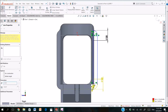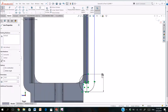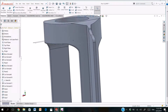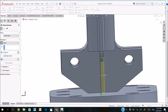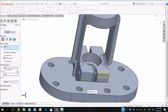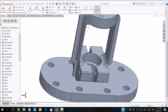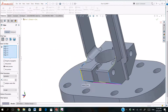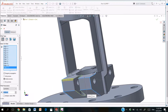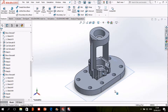To make the edges better, I'll draw two circles and a line between them and complete them. Then extrude them and make the edges filleted. I'll complete the edge under it and make it the same. This is the final shape after making all the edges filleted.